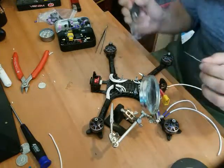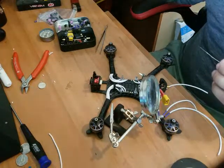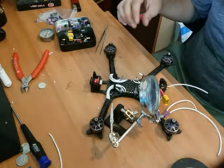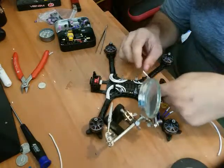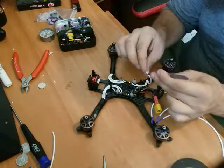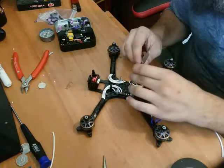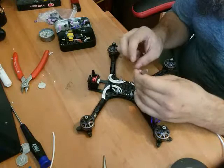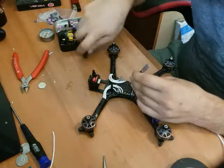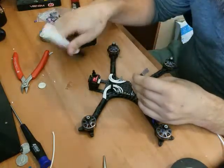Since it's all fluxed up, I got a clean tip on the soldering iron at, some people would call it, an unreasonably high temperature on the iron, but I like to have it on there for the least time possible so it doesn't heat soak the PCB. I found if I'm at a lower temperature, personally for me, this is completely my own opinion, but if you're too low of a temperature, you tend to heat soak the PCB, and that's how you get damaged components. And now we'll get a little more flux on her. There we go.